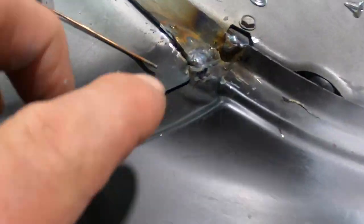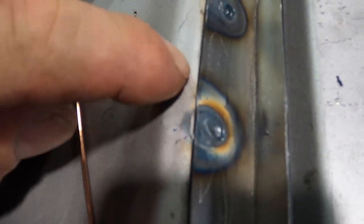It's a good boy. All right, so I put a weld on this seam. It came out all right, but I tried the spot weld feature and it just wasn't enough, so I just TIG welded in each little hole and it's holding it down pretty good. I just drilled this out because where I have the tech screws, it's really not holding very good, so I opened this one up.